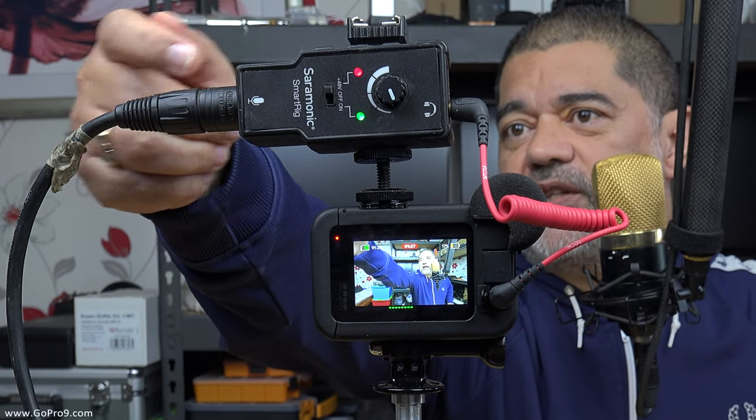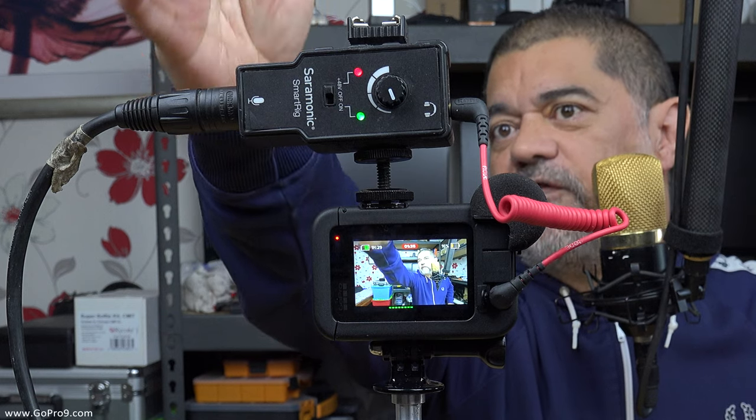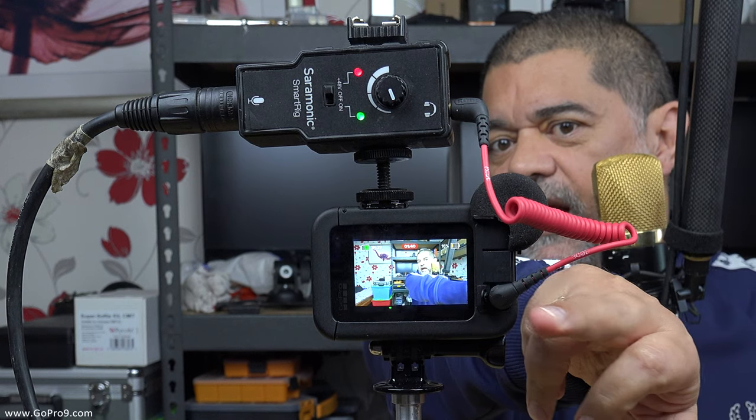Okay, so for a clear demonstration of how all this works: right now I'm on the microphone, which is an XLR microphone that requires 48 volts of phantom power. The microphone is connected into the Saramonic via XLR, I set the appropriate gain on the front and make sure phantom power is switched on, then the output comes out of the Saramonic and into the mic input on the GoPro's media mod. What we're hearing here is this whole thing working as it should.